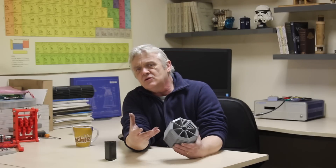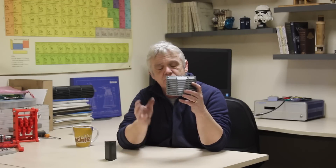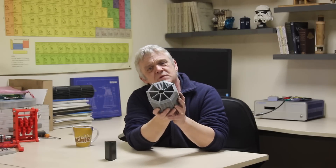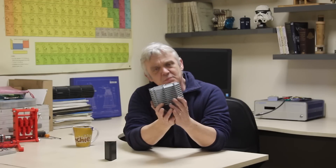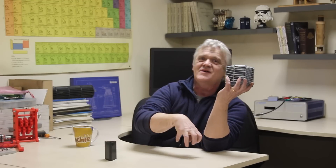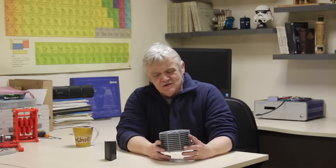If we put that on a pipe the wind's going to go down that pipe and we can put a venturi in it to get some real speed out of it. This bit — which is a lump of plastic with no moving parts, or could easily be a lump of wood — can be stuck cheaply and easily up in the air to do that job and bring all of that wind down. To my mind, without moving parts, angled at 35 degrees, using cheesy wedges to make a pie, is a breakthrough. I'm just so pleased about that, and you can bet I'll be doing more on this.